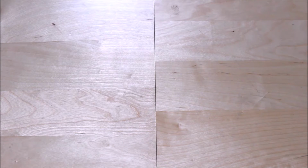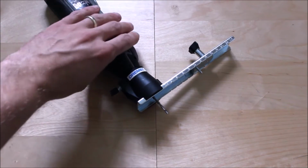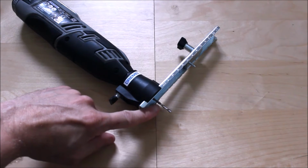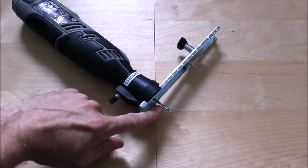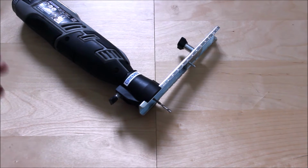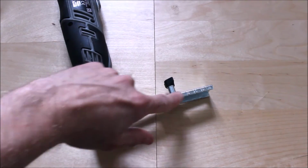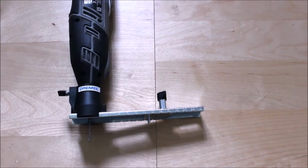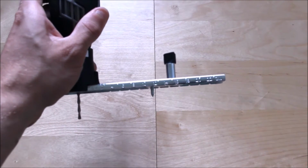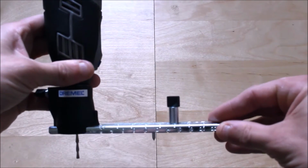However, if you're an owner of a Dremel like the one I've got here, this is my rechargeable Dremel, and I have a 2mm spiral milling tool. This is a special drill bit, and what this will enable you to do is cut circles along plastic sheets or metal or wood components. This has a special device which is a bit like a compass in a way, and you have a fulcrum point here. You adjust your settings, the size, the diameter. Now obviously this is already set to the circle that I'm going to cut.